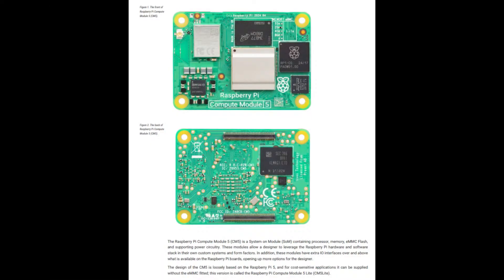The CM5 was just announced. It is a pre-order right now, but it looks like they're going to be in quarter one of 2025. So pre-order now, and by the time you get back from holidays and get over your eggnog hangover, you will be ready to integrate this into your design. It's really packed — I think it's like 40 by 55 millimeters — completely packed with everything, including the new RP1 GPIO manager, which gives you PCIe and PIO lib for ultra-high-fast GPIO programmability on the fly.